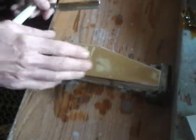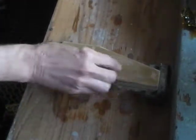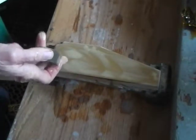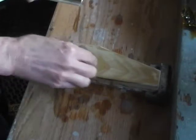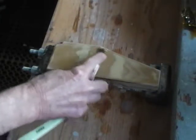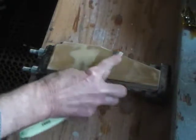I think I can continue with this slurry, or at this stage I can make a slurry with a tomonagura, a slurry stone, just to speed up the process. This tomo is matched so that the predominant slurry component is from the Kiita stone and not from this piece of sagi. This is from a different stone that I cut. So what we want is, this Kiita is the better grade stone, so we want to harvest more of the slurry component from the Kiita.